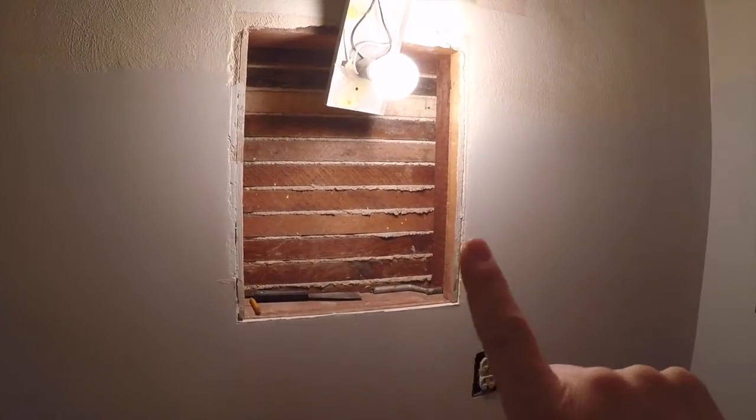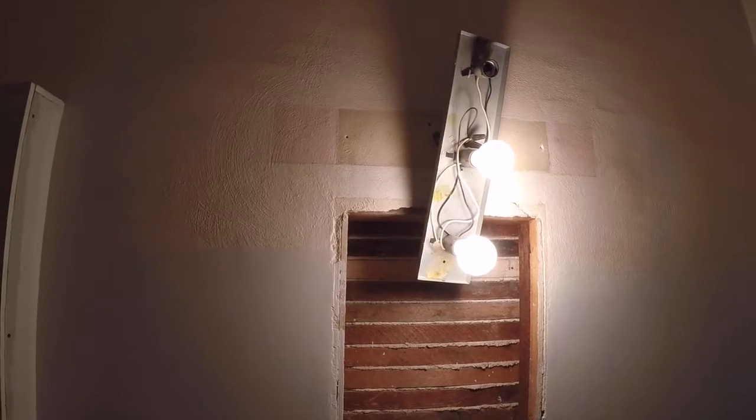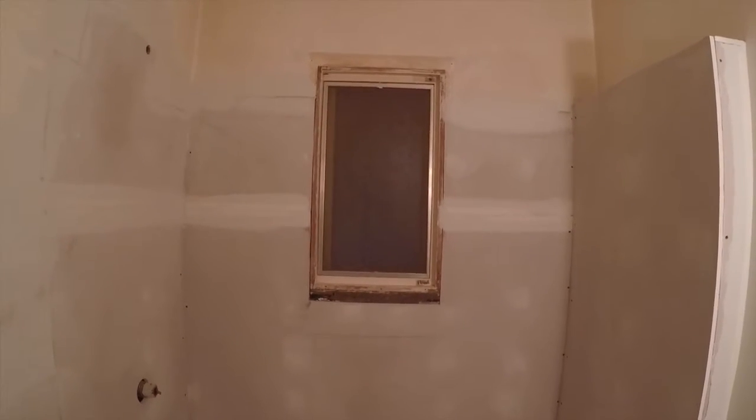So I'm not real wild about the light fixture. It has a wood trim that goes around it that's wood colored, kind of a darker like this here. I think what I'm going to do is just keep the light fixture, clean it up, and paint the trim the same color that I'm going to paint the trim that's going to go around the window, which is going to be white. And then the trim around the doorway. The top piece is still there, but I pulled the two sides off to do these two walls. I'm going to install the same trim back up there and paint it and fill the holes and just reuse it. The trim that was over that window I destroyed taking it out, so I'm going to have to retrim that. I'll have to buy a stick of wood to do that. I'm not buying trim, I'm just buying 1/2 inch by about 3 inch wide pine board and make my own trim.